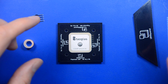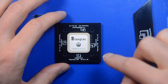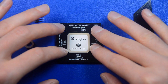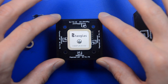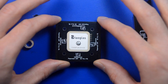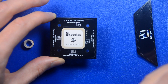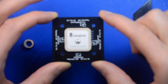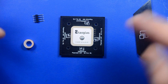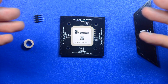One of them is multipath — GPS signals being reflected from other objects and interfering with the actual direct signal from the GPS satellites. For example, your quadcopter is sitting on the ground, this board is very close to the ground, and you get reflections that cancel each other out. Then you take off a few meters and suddenly your GPS starts drifting because it is adjusting for all the changes. You don't want that.